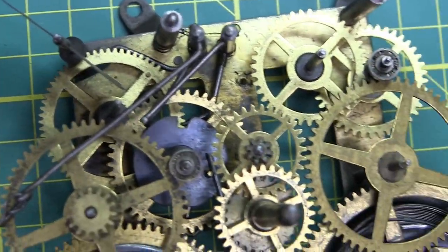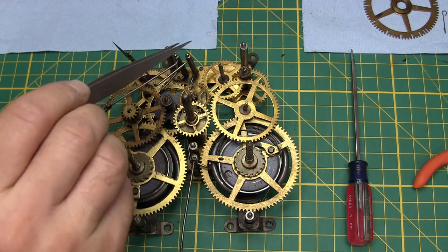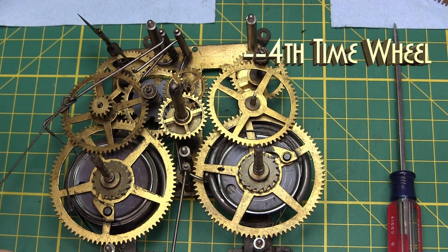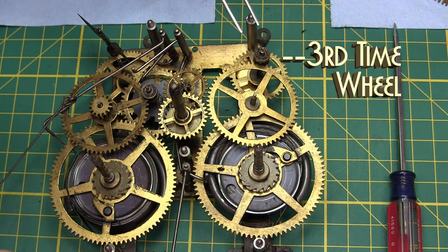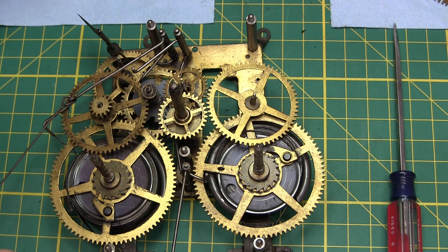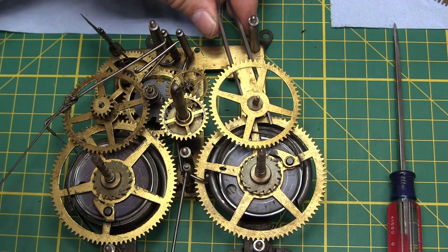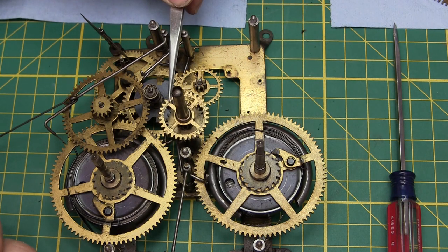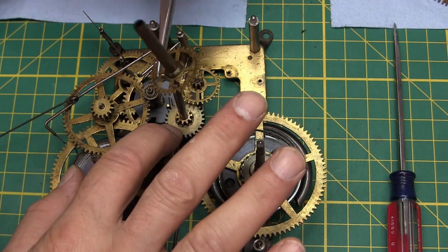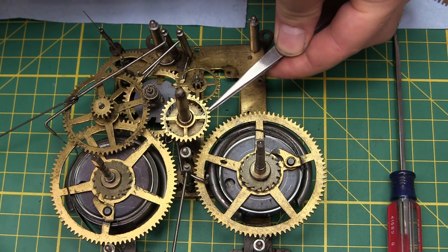When you put it back, let's try to make it look like that. The escape wheel goes here, which I took off — I'm just going to go in reverse. This one comes out and goes up on the blue towel directly below the escape wheel. The next one — just a little gentle upward motion. Next is this one. This just slides over the top — the hour pipe slides over the top. We're just going to take the whole thing out together and separate it later.